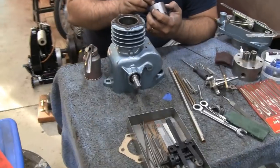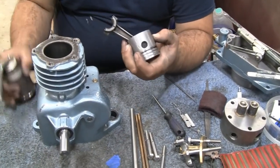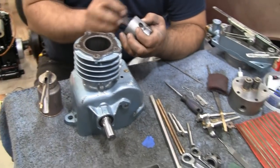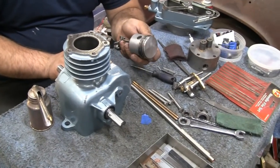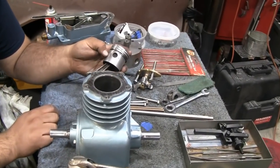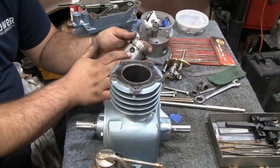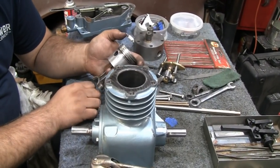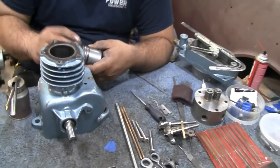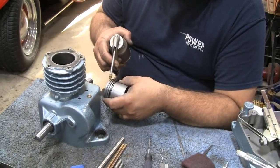He's dicking around, mostly cleaning. The piston had never been cleaned — it's been sitting around for two years. Had to clean out the carbon and clean everything. The piston itself is a little rough with two big scores in it, so he filed those down so all the scratching is below the outer diameter of the piston. It looks rough but for this purpose it'll work fine. The ring grooves are clean and the rings feel okay, maybe a little weak.